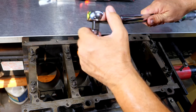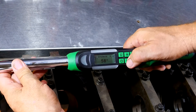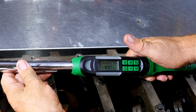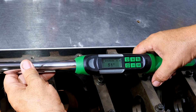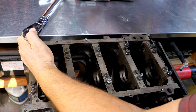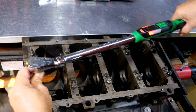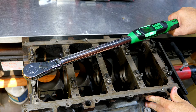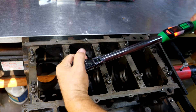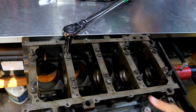For the larger fasteners, I'll change over to the half-inch drive. Here I need 51 degrees — so we've torqued to 15 foot-pounds and now we've got 51 degrees. Doing the outers at 51 degrees — a little bit easier with this larger torque wrench. There we go — same audible beep, audible chirp, lights, and vibration. Love these torque wrenches.